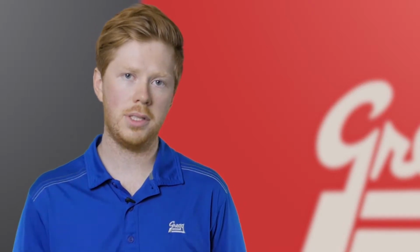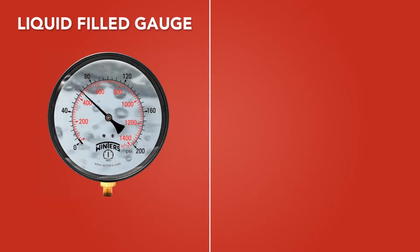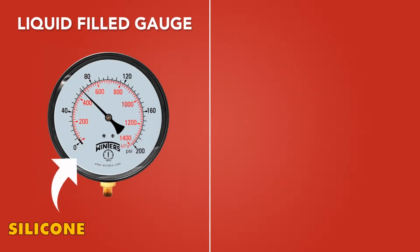As nice as these accuracy readings are to have, there are still some other factors that can change the ability of a gauge to read properly. The biggest of these is vibrations. This is why there are 2 main types of pressure gauges: dry gauges and fluid-filled gauges. A fluid-filled gauge, like the name suggests, has a specially formulated fluid inside the gauge that acts as a dampener to vibrations. The Bourdon tube, linkages, and other parts are suspended inside this fluid. These liquids are usually substances like silicone or glycerin that help reduce vibrations, but can also extend the temperature range in which the device is usable.